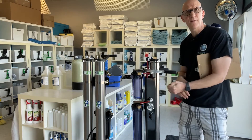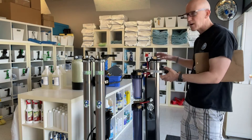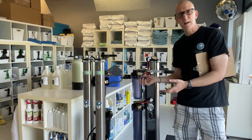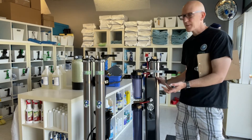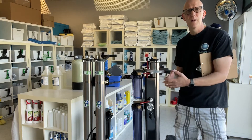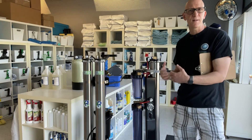Other than that, if over time — let's say a year or two — you start to notice you're changing the DI a lot more often, that's basically giving you the signs that the RO is starting to go. ROs never fail suddenly. It won't be one day it's working great and the next day not — especially when it comes to TDS, it's very, very gradual. I've worked up a formula that I think is pretty simple for you to tell what your RO is working at so you can get an idea of its health.